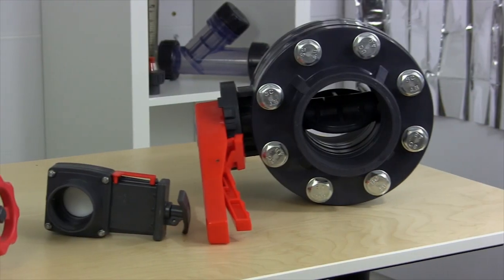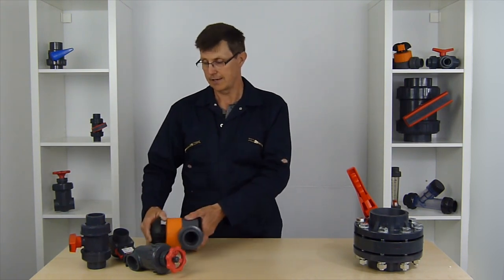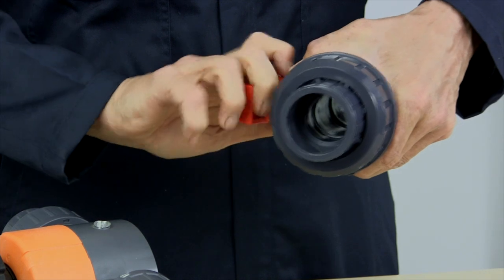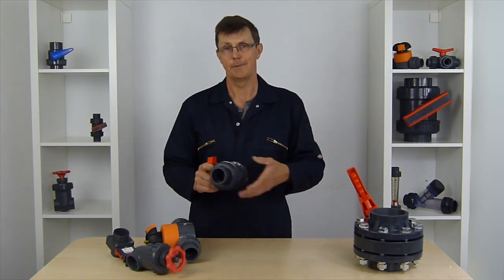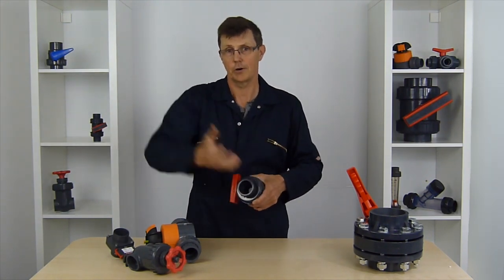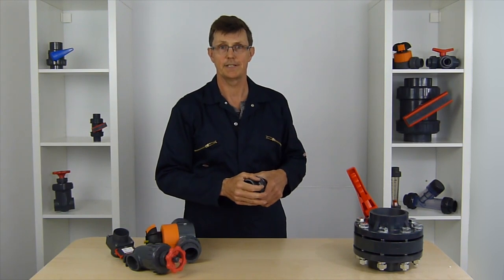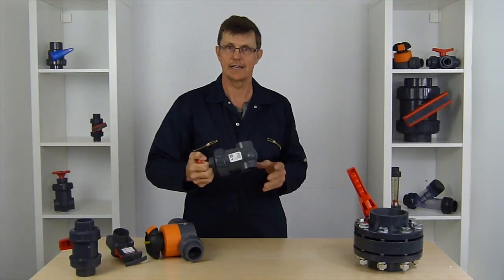There we have a brief overview of the different kinds of valve. One last thing to mention is water hammer. If you've got water coming down from a high header tank, or from a pump without any speed control, something like a ball valve or gate valve you can very quickly shut — you can really whack them shut very quickly, and it's the same with butterfly valves. The problem is, if someone whacks that valve shut, you get a shockwave which comes down your pipe, bounces back because the water is hitting that shut valve and travelling at velocity. That can very often fracture weak parts of your pipe system. To avoid that, some people prefer valves like these where it's impossible to shut the valve really quickly — so you don't get water hammer at all with them.